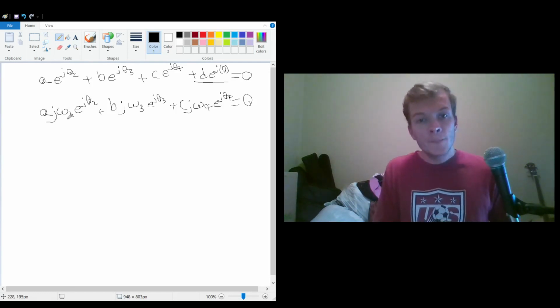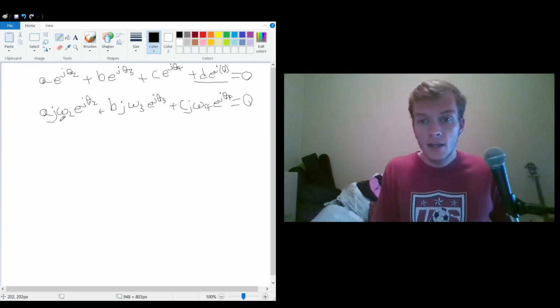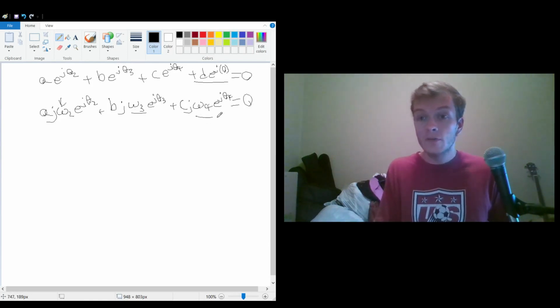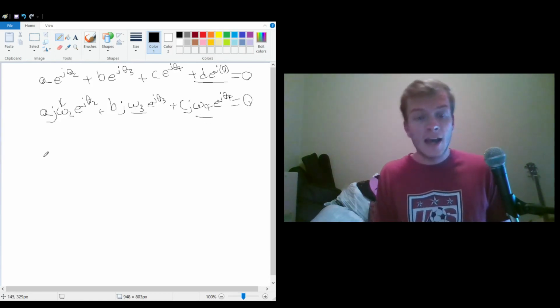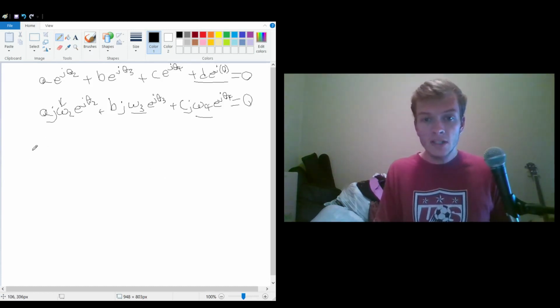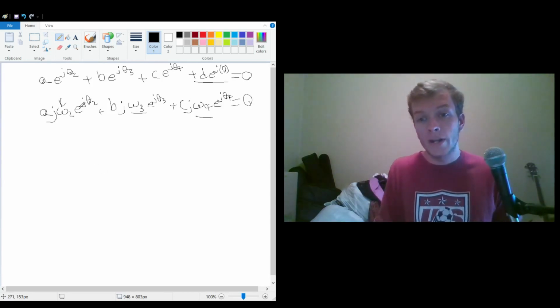So let's say, since we're controlling our linkage A, we can actually adjust the value of what omega 2 is. Well, that only leaves 2 things we don't know: omega 3 and omega 4. So once again, and I'm not going to write it out just for time's sake, but we can decompose this into sines and cosines. Now, there is something interesting I want to point out.